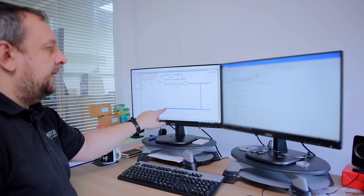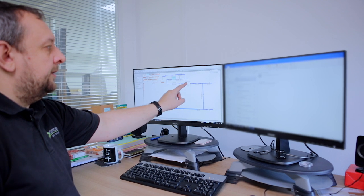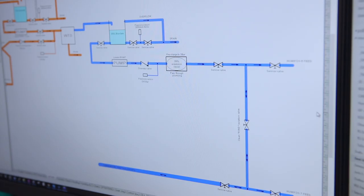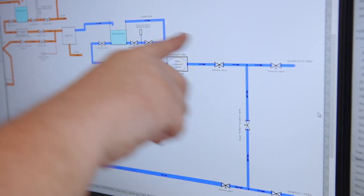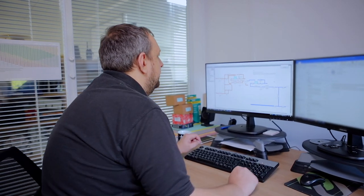The outputs feed two humidifiers that are on the same air handling unit. As you can see, one of them is fed from the other room and the other one is fed from this room, which we are currently rebuilding. So we have a means of feeding them both from either feed, and also to supply water from this system back into the other room should a failure occur on that side. That's the diagram of what we're going to build.